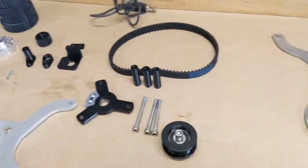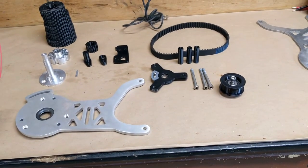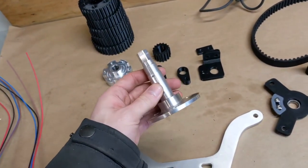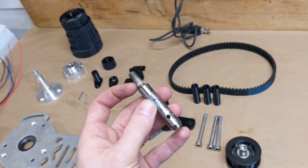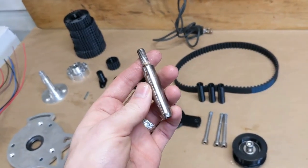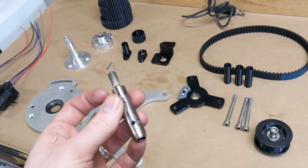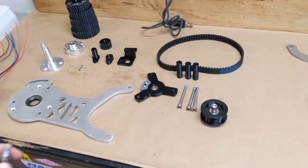Back to this. When I was trying to design how to mount the crank trigger wheel, I didn't have a good way to mount it where timing wouldn't wander. So this is going to be the new piece we use to mount our pulley and trigger wheel — it'll bolt straight to the rotor. The old way was just this little piece threaded into the end of the crankshaft, and the V-belt pulley set screw grabbed onto this little shaft. Obviously this isn't a great design. The problem is I can't put a trigger wheel on this because depending on how tight you thread it is going to change where your trigger wheel is and screw up your timing.